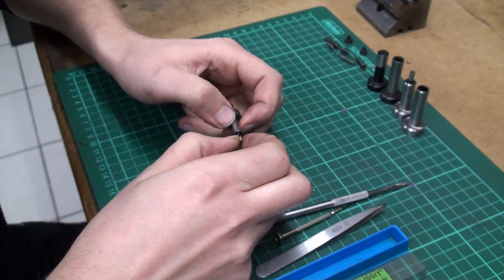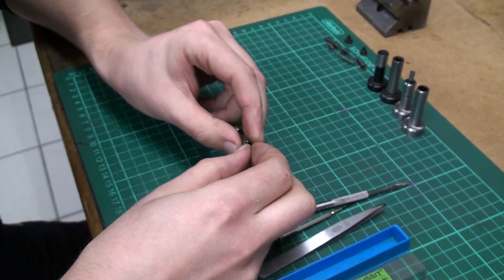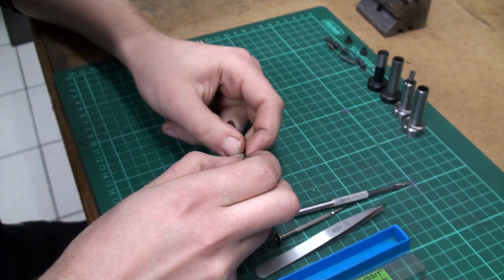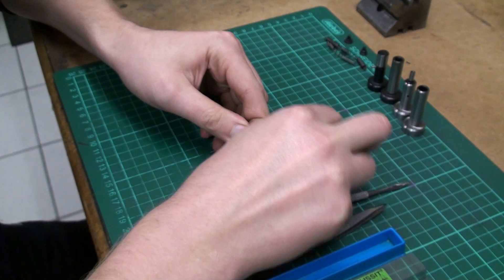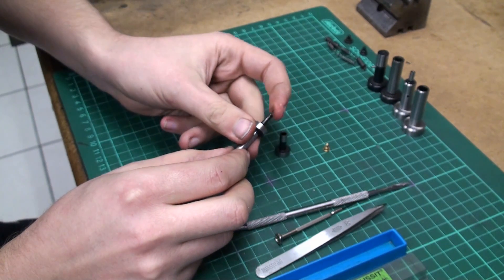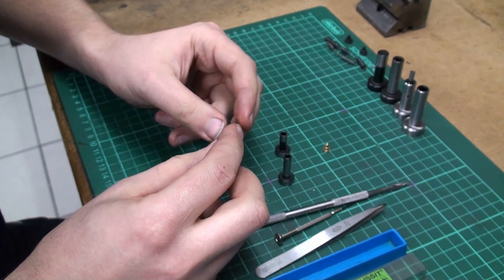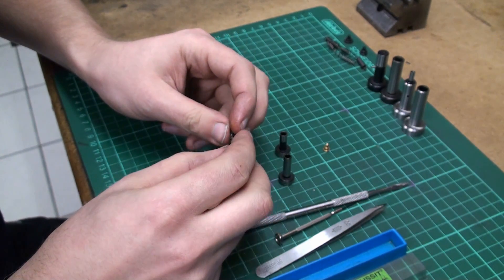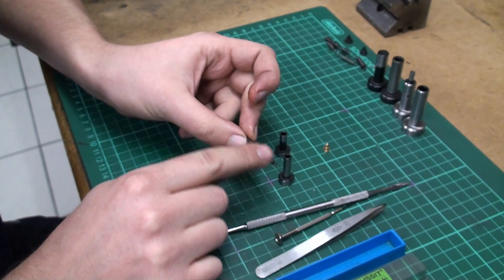So let's go — this shouldn't be too hard. Just pull the brass plug on the end out, hold it and unscrew the brass cap, then let it go and the spring snaps back so you can pull it apart. As it looks, this spring also got a little hit, but I don't think it's a problem because in the middle area where the spring is tensioned there is no damage to it.